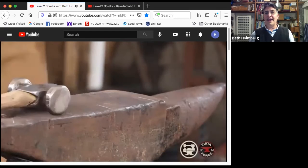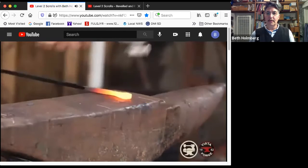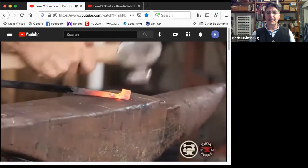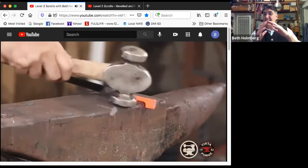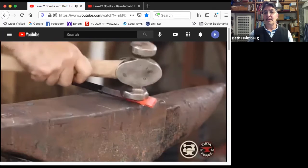You'll see the edges off in the neck. So a little bit of cleanup. Make sure it's flat. That gives me a chance to see, it's got a little bit of a point on the top. I'm going to take that little guy down. That looks good to me. So what I'm doing now, I'm just knocking the edges off the neck area, maybe the first inch or two, because this is where I'm going to do a secret twist. And if you twist corners, they tend to stick out more. If I just dull them a little bit, it'll look a little bit better. It'll work better.